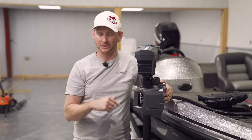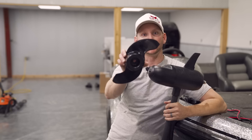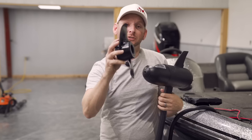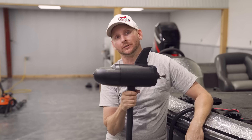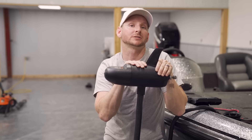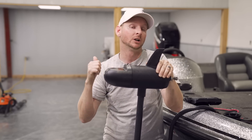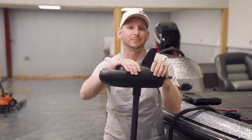Starting with the prop: basic two-blade trolling motor prop, very similar to competitor products. But what really makes up the efficiency is the motor. This is one of the first trolling motors to market with a brushless system. Brushless means way more efficiency, way more thrust, less maintenance, and less things to go wrong — fewer wearable parts compared to a brush motor. Your Ultrex, Fortrex, Motor Guide X5, XI5, Tour Edition — all use a brushed motor.